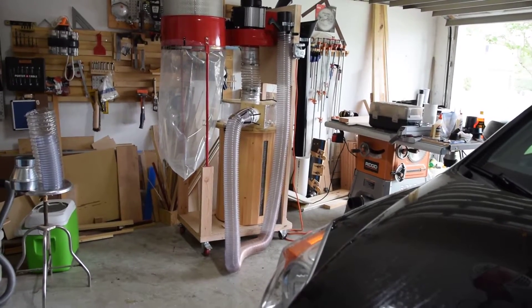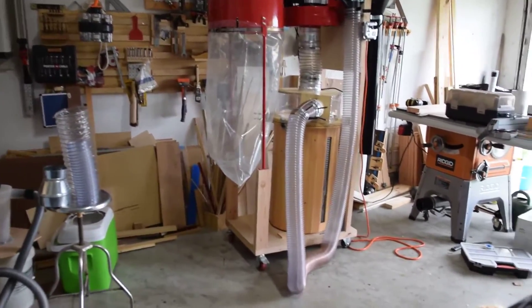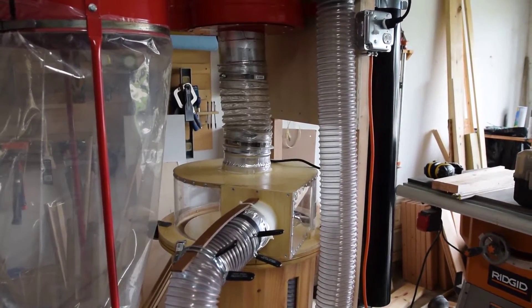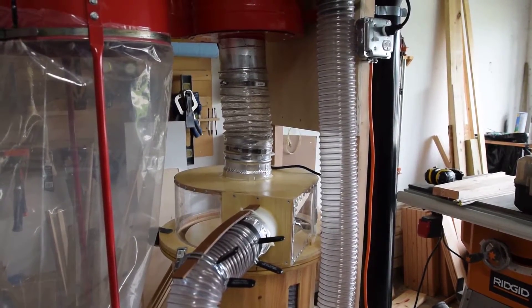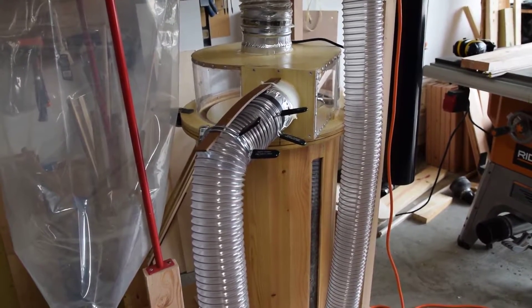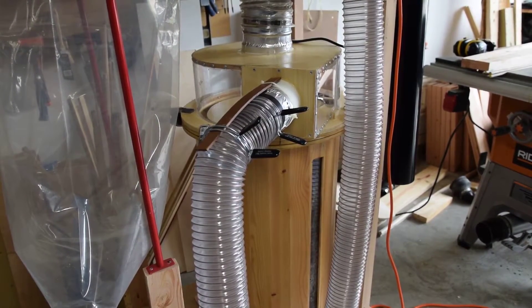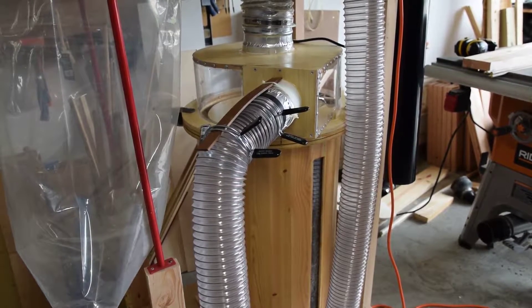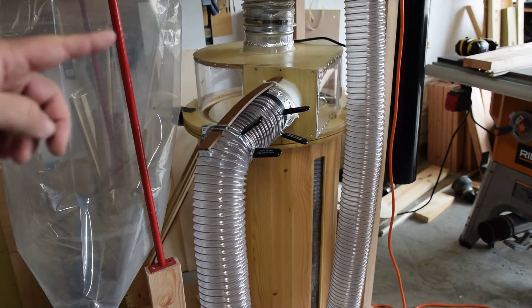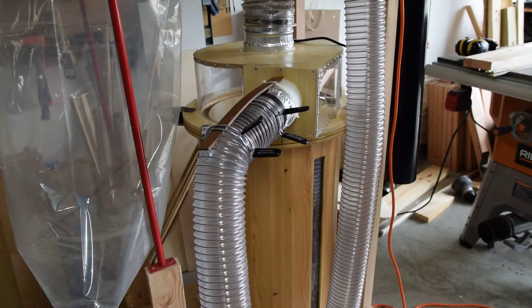Let's get a little closer look at what I've done. Here is the six-inch hose going directly from the motor to the top of the fine baffle, and it goes down to the fine baffle to a four-inch Rockler hose. This hardboard is used to keep the hose from kinking, as the weight of the hose causes it to bend at an unnatural 90 degrees which also kills suction. So I use the hardboard to extend the hose so it does not bend and cut suction by drooping too sharply.